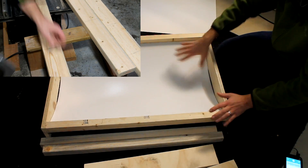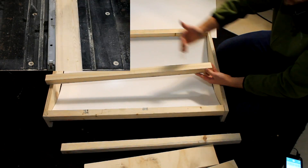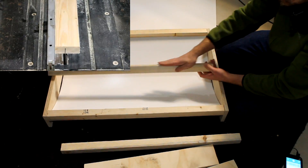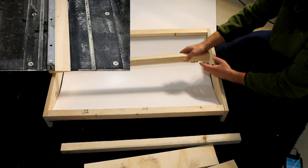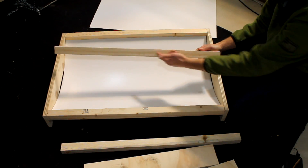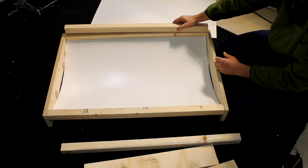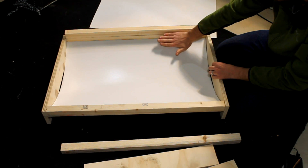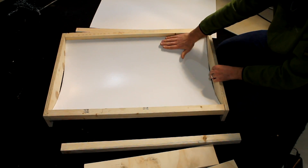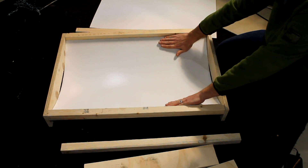You can go flat and just make a square box and put your LEDs in there — whatever you want to do. But this is how I chose to do it. I cut some two-by-fours down to the length I needed and then ripped them down to an inch-and-a-half by inch-and-a-half square stock. Then I set my table saw at about a 20 to 25 degree angle and ran these all through to get a slot cut into the edge on an angle. The melamine fits right into that slot, and I had to run it through twice to make the slot wide enough for the quarter-inch melamine. It goes in almost three-quarters of the way through at an angle into the square stock on the corners.